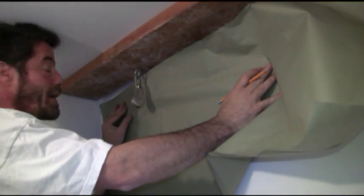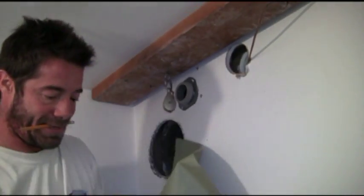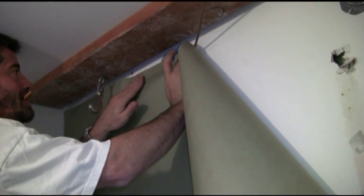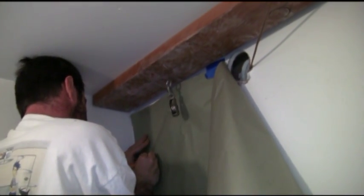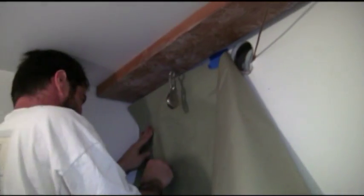What are you doing? Trying to make a template for my holes. Really — it's not going to be a fun part. Scott plans to line the inside of the upper cabinet area above his 500-gallon aquarium with FRP — fiberglass reinforced plastic — sheets that attach over the drywall and help minimize moisture condensation inside the cabinet. To make sure all panels fit properly, we need to cut holes and notches for the vent hole and pulley cable pass-throughs. It's easier to do this on a paper template now and transfer that information to the FRP later.